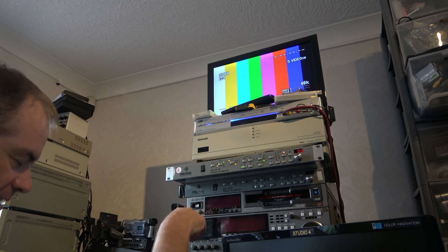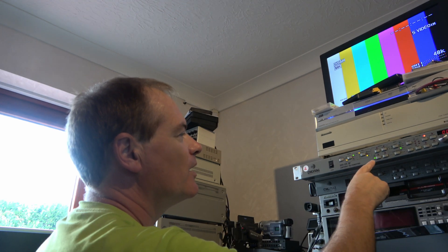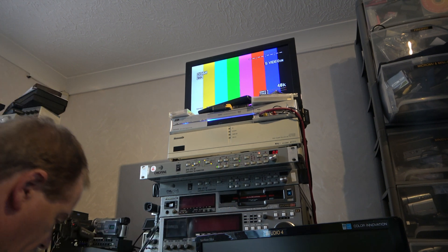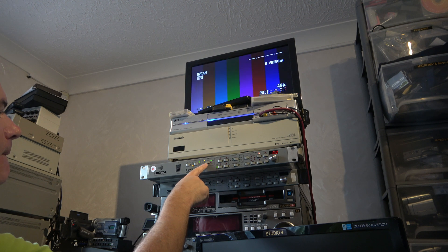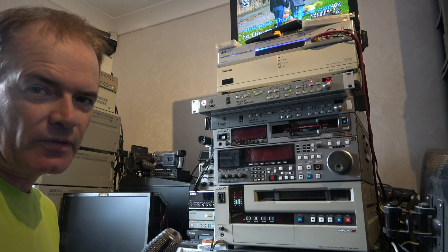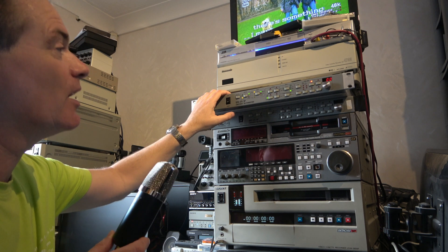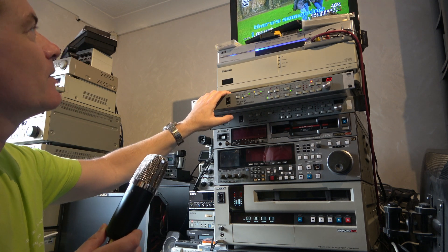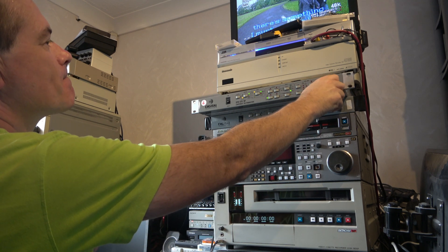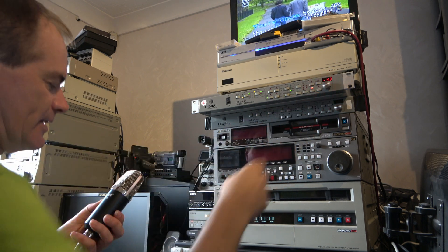So how I select the input — it's YC. We'll try it now. Oh, there it is — that's worked straight away, which implies that this machine was probably last used with U-Matic. I think there's too much chroma, so I'll set the chroma level down a bit. I found this one's got too much chroma as well — I could set that more scientifically later.